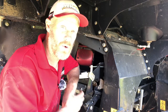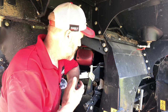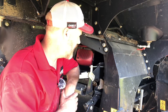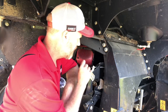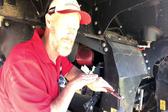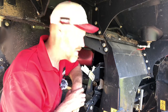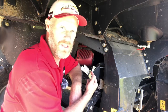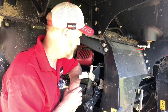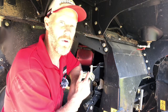So we want to calibrate this to something that means something to us. For corn, I'll often hear it's in the fourth notch. Now depending on what pre-sieve you have, you may calibrate it differently. Guys who do a lot of wheat run the 1/8 pre-sieve and want a minimum opening of about 1/8 of an inch — we don't want to close it all the way flat because we lose the edge to walk grain to the back of the machine. So we set the minimum to 1/8 of an inch. For most corn and bean guys, we run the 1-5/8 closed slat pre-sieve, and typically we want to run that at around 10mm in corn. So I'll calibrate the fourth notch to 10mm.